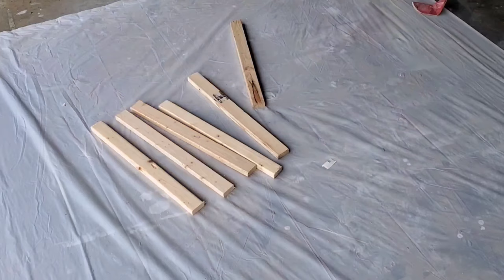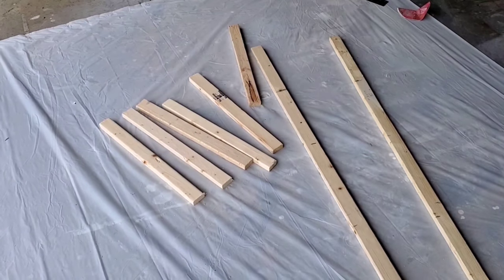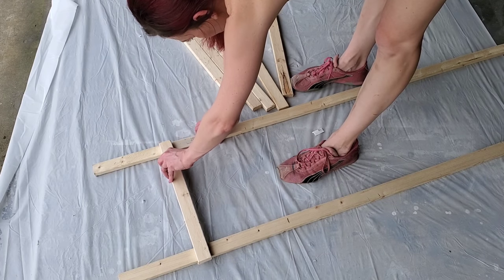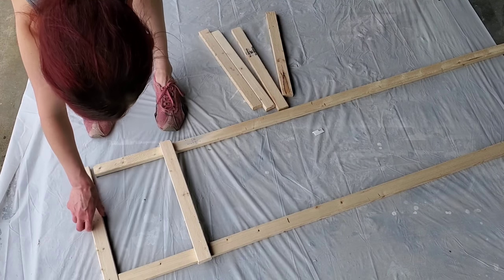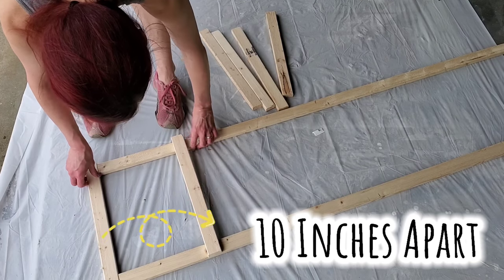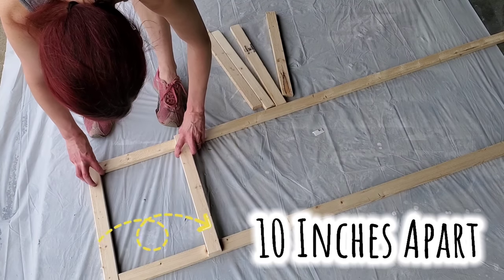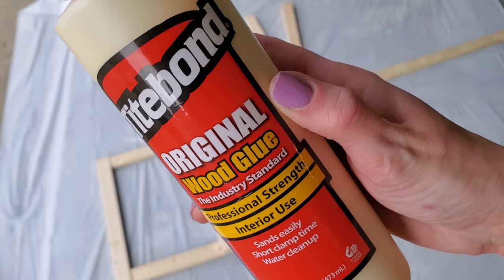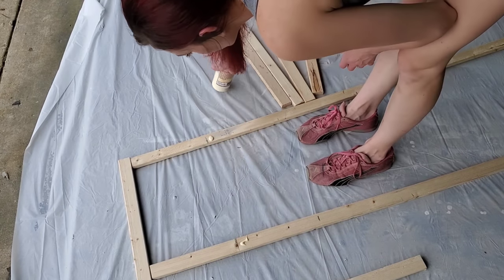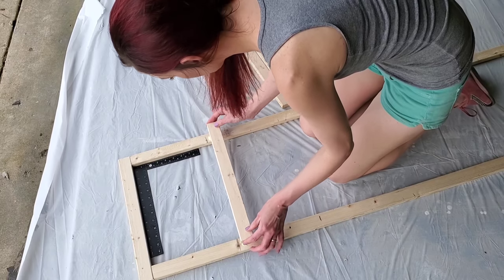The first time I cut the wood I didn't use any clamp at all. So now we have two strips of wood at 80 inches long and six strips at 16 inches each. I decided how far apart I wanted the rungs — I went with 10 inches spacing — then I whipped out the wood glue. Any kind of wood glue will work.